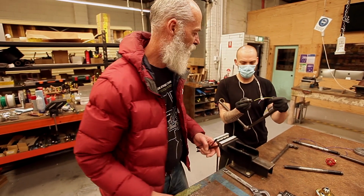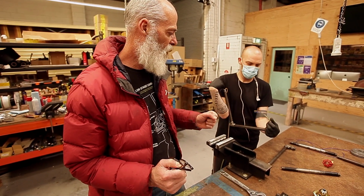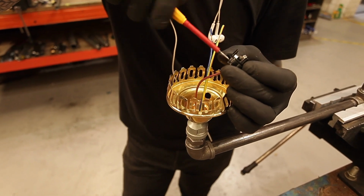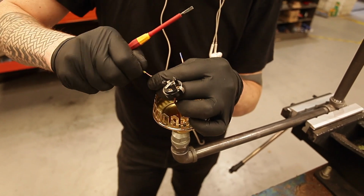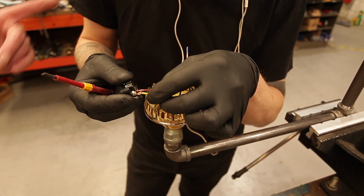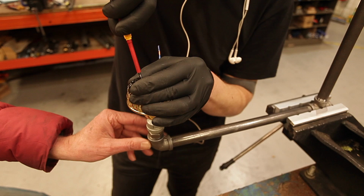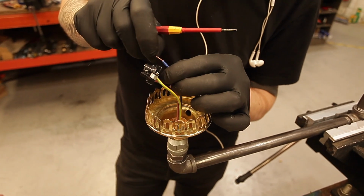And Massimo's just tightening these pipes as we go to get them into the right position, tight, so that they don't come undone, and with the appropriate bits of hardware that we discussed before. There will be the active, and the earth, which will connect ground to the pipe as well, because we're all connected up. So it's the ground or earth, which connects earth to all of the plumbing pipe, the gallery, the lamp holder. Everything's all now connected to an earth wire.